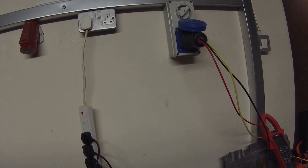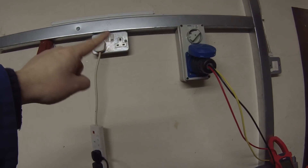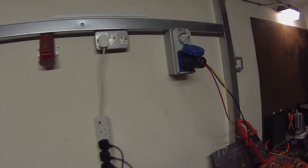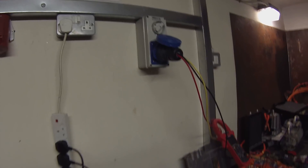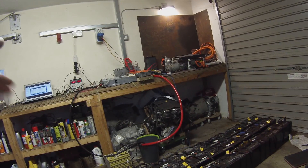The power supply cables are 6 square millimetre, which is again going to prove to be inadequate. I have upgraded the circuit breaker for this socket — it was 32 amps, it's now 45 — and yes, that's naughty. Anyway, promise not to talk too much... and here I am talking too much. Let's get to it.